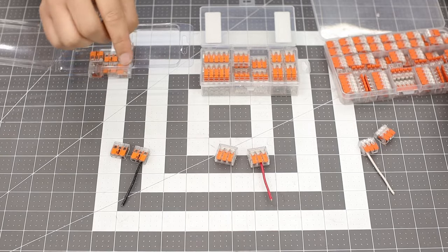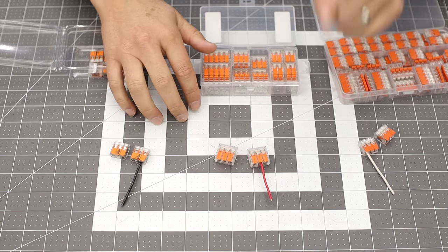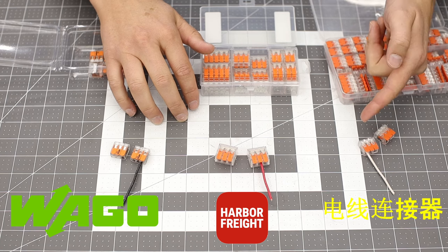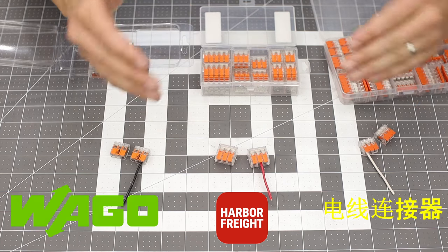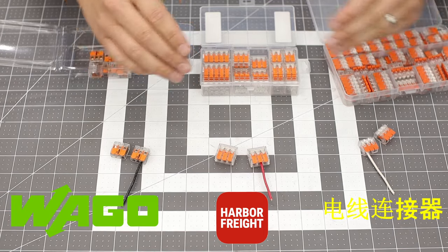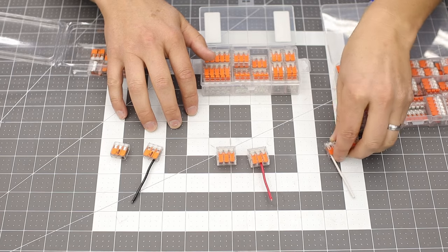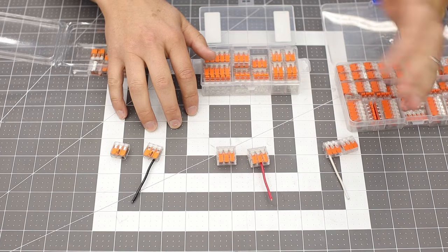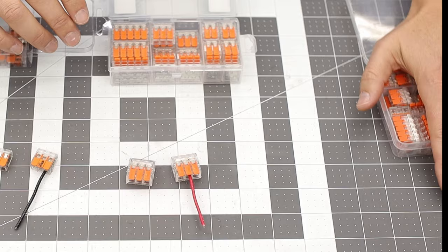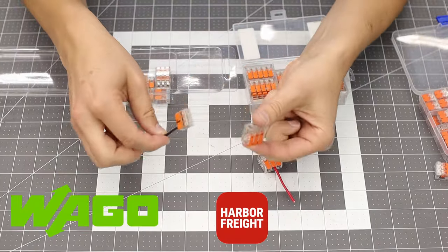I've seen other videos, and I do know that they can all get up to the 32 amps, and the temperature on this one did get a little hotter, but it still was below the 221 allowable degrees. First of all, the cheap ones, I would only use them for simple DIY projects where I could actually see the wire or just simple little connections. I just don't have those tingly good feelings in the walls for these ones. It will mostly come down between these two.